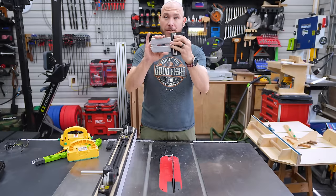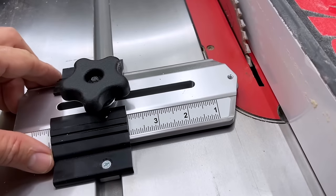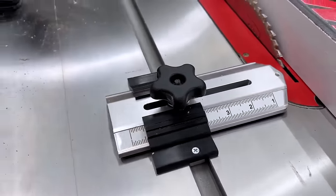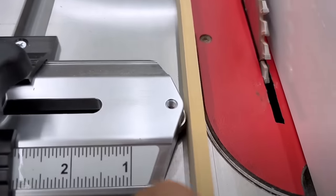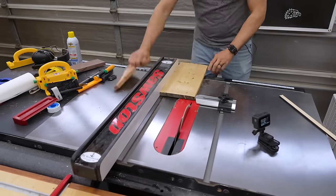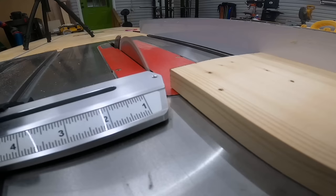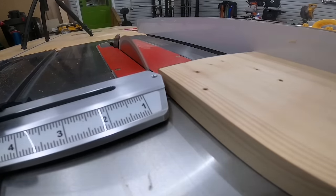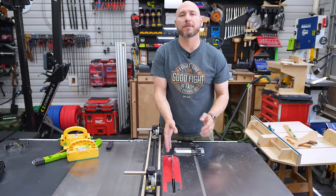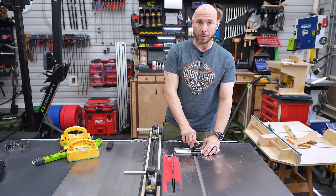The last jig is a thin rip jig — it kind of looks like a spaceship thing. It goes into any standard T-slot. What I like about it is it cuts the thin pieces on the left side of the blade. You set this jig to the thickness of the thin stock you want — so if it's one-eighth inch, you'll cut that first piece an eighth inch, then move your fence over and make the second cut, which is also going to be an eighth of an inch. This way you don't wind up with a tiny space between the blade and the fence that you can't cut safely. I like this because it's cheap and it works.